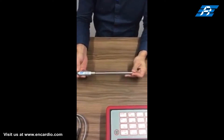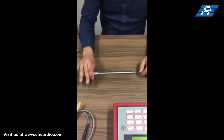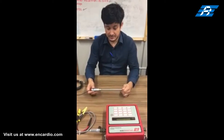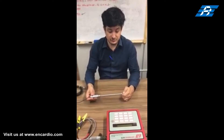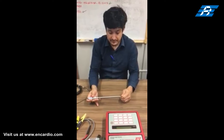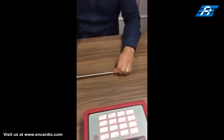Through a precision coil spring, for monitoring displacement in any application, this shaft slides inside the sensor body. Any change in position of the shaft deflects the spring proportionally, and this in turn affects tension in the stretched wire. Thus any change in displacement directly affects tension in the wire and thus the frequency of vibration.